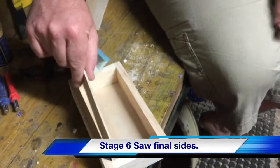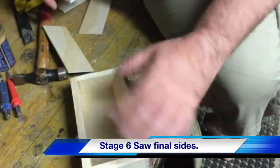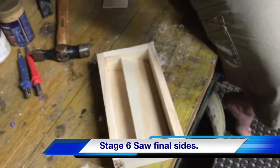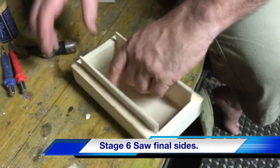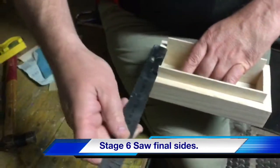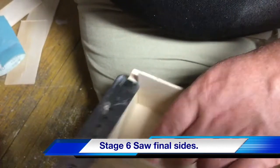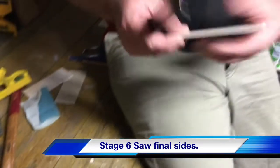And this is what you do. You're going to place them there in the box. Oh, no, that way, on the ends down where you just sawn. And you're going to put them in there like that. Now I need to measure the next side. So you've got to allow for the two edges of your wood, which is 70 millimetres, so mark it off. 70 millimetres.